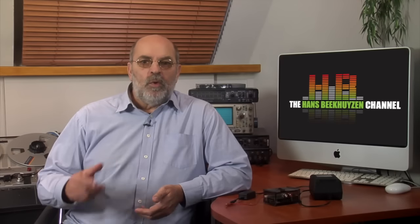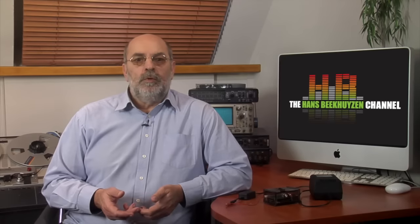A month ago, Scott C. Kramer gave me the following reaction on the DAC board review. If you still have the DAC, you should try it with a linear power supply. You can solder a header to the board that can power both the Pi and the DAC. Another benefit is this bypasses the Pi switching power supply, fuse protection, etc. This gave a very big improvement to the sound, very, very smooth.